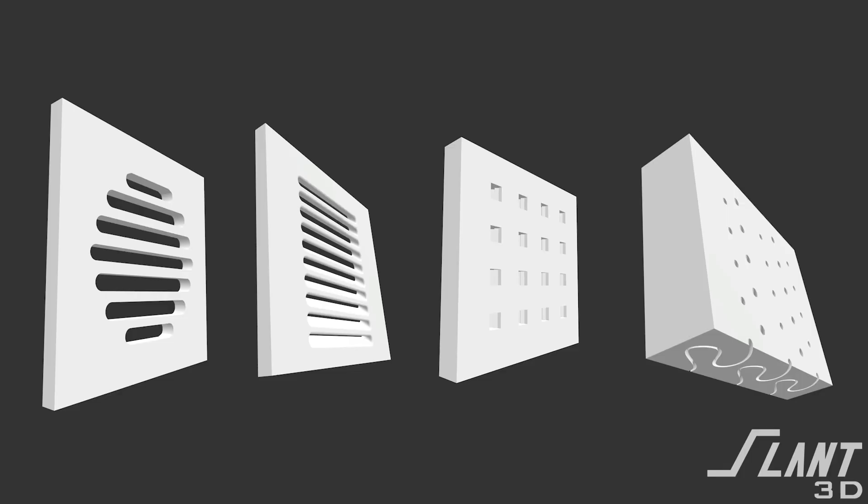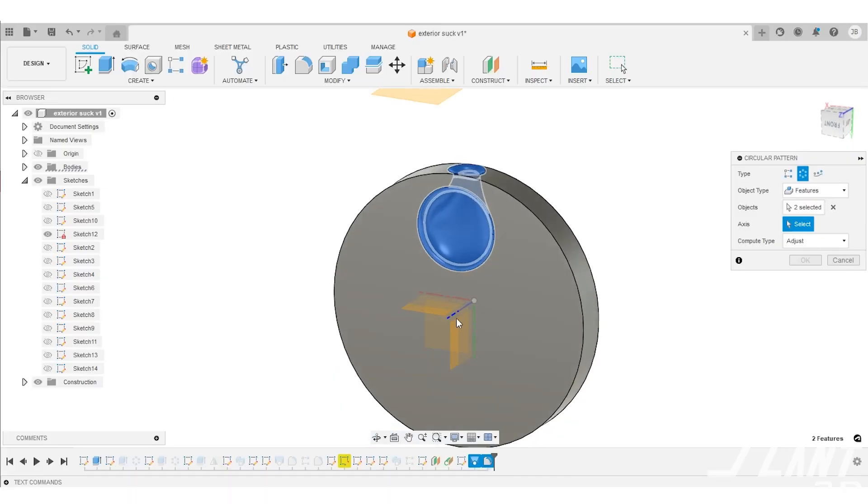So we've gone through all the different ways to have a flat plate with holes in it. With 3D printing you have much more control: you can create complex internal structures to catch dirt, increase noise dampening, disturb air for better heat exchange, or block light to control how your product looks. You can also make designs more manufacturable than standard holes simply by putting tapered or angled holes through. But there's one step further — all of what we've discussed goes from one side of the plate to the other in essentially a straight line. What if you don't want to pull air straight through, but want to bring it from somewhere else entirely or avoid a front-facing pattern of holes?